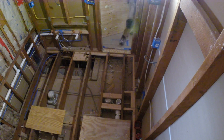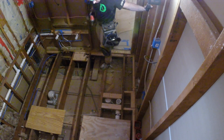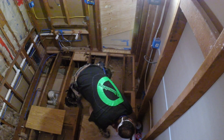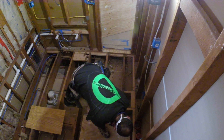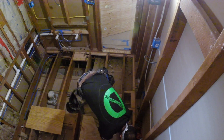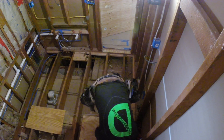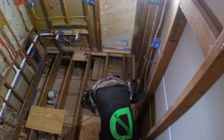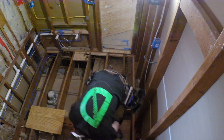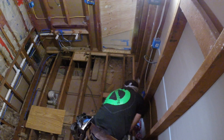I always stress this a lot to people when installing wood: the only thing drywall screws are really meant for is drywall. Whatever construction application you're doing and using a screw, make sure it's made for that purpose. If you use drywall screws on a subfloor that's getting a lot of stress and weight, the heads on those drywall screws will actually snap off completely.